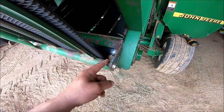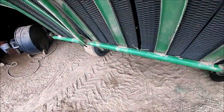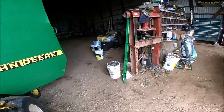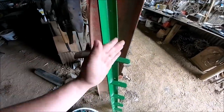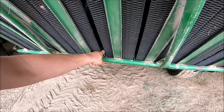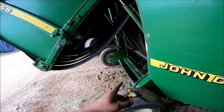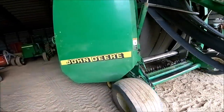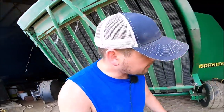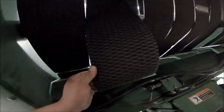You can see on the bar where we did some welding. See how that's ground up - these teeth are supposed to help divide the belts so they don't overlap each other. We knocked them off just because we couldn't get the bar bent back far enough, but that bar is going back in new. On this side I'm pretty sure there's an issue - let me walk around here. On this side this belt is coming out - I'm either going to replace it altogether or put a splice in it, but it's got a cut in it right there in the back.